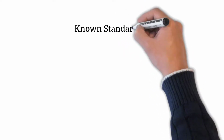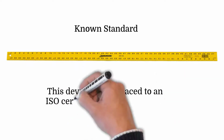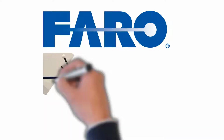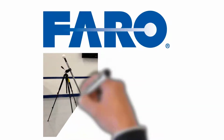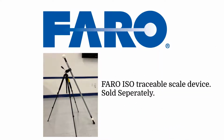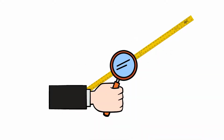One recommended standard is a 4-foot scale bar for field use, that is traceable to an ISO-certified device. This device is inexpensive and can be confirmed and documented using your ISO-certified standard. Faro offers a calibrated scale bar using a certified measuring device traceable to the International System of Units through a National Metrological Institute and ISO 17025 accredited laboratory. Let's take a look at how we can utilize a scale bar for accuracy confirmation.